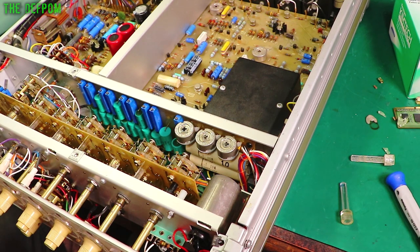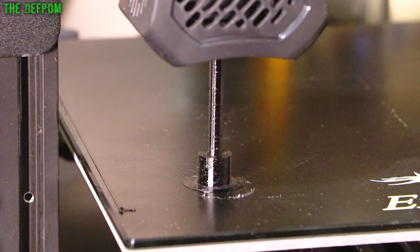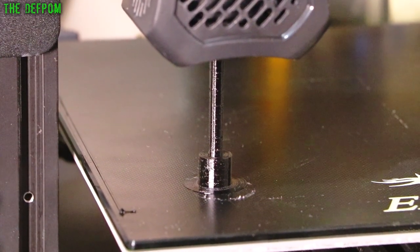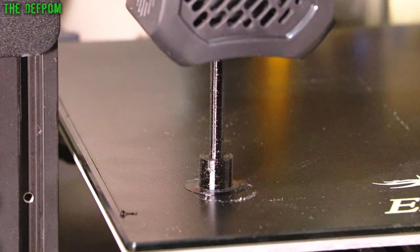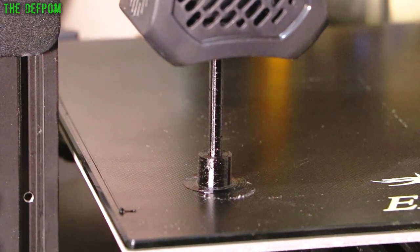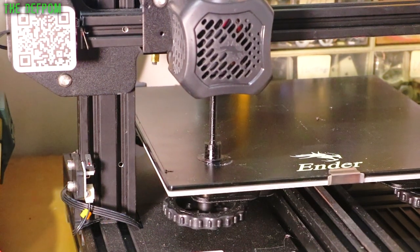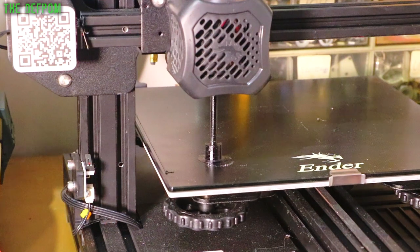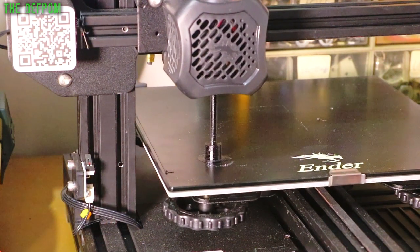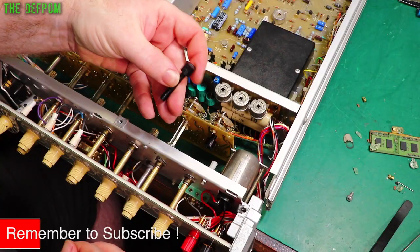Because I'm using PETG instead of PLA it's a bit different too. You can see it's almost finished printing — 97% done. This is version 2, with dimensions made very slightly thicker to reduce tolerances and make it a little bit tighter fitting on the actual switch wafers. Hopefully this one will be better. It's using a 0.4mm nozzle — not as precise as I'd like, since my other printer has a 0.2mm nozzle and does really precisely — but this is good enough for this.